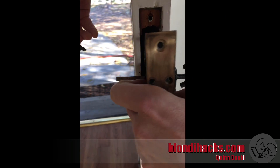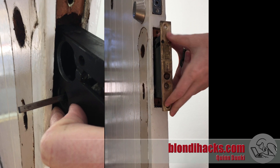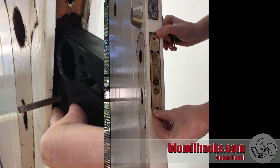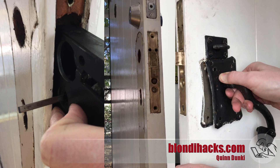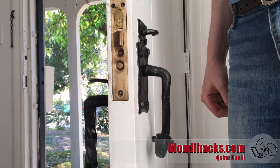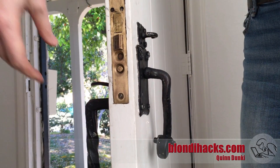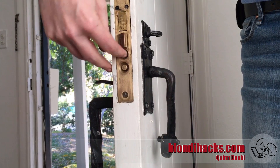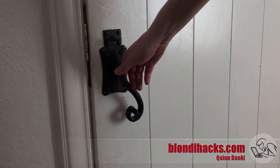Let's reinstall this thing on site. I left that shaft long, so I marked and cut it to length, and now we can just insert this back in the door. It's a perfect fit, thanks to the new flush mounting bolt that we made. The handle goes back on perfectly. We can set the angle of that handle by just shifting it in the lock. Deadbolt works perfectly, outside latch works perfectly, mode buttons work. Everything feels really smooth and really nice. Perfect.